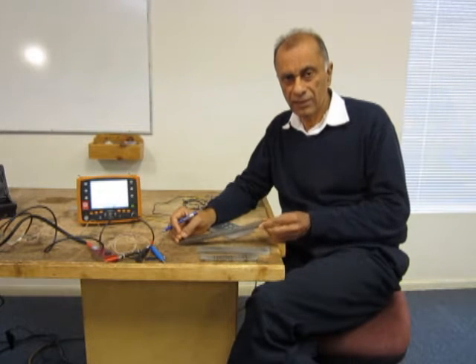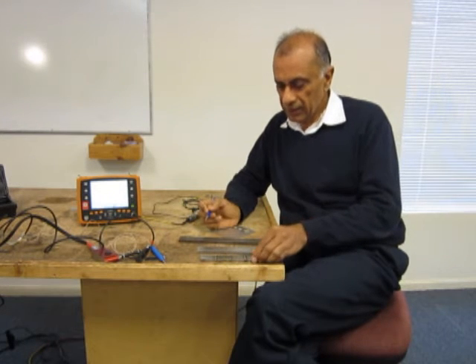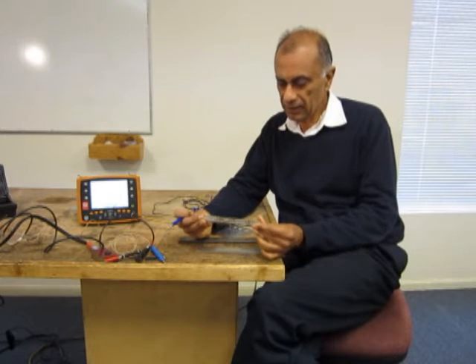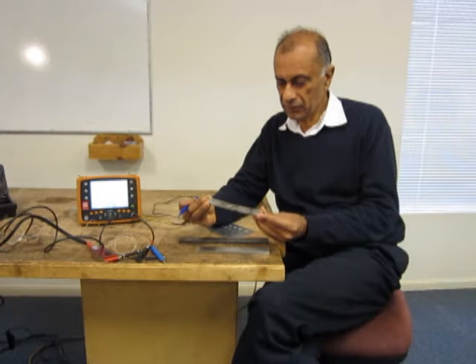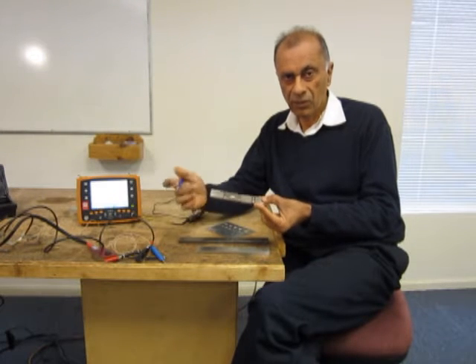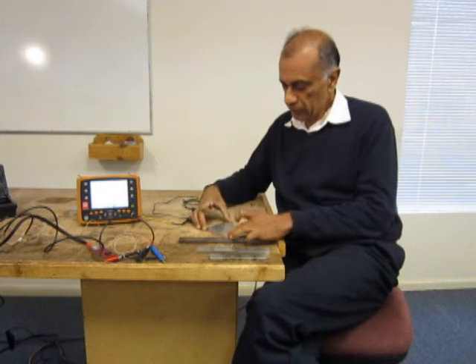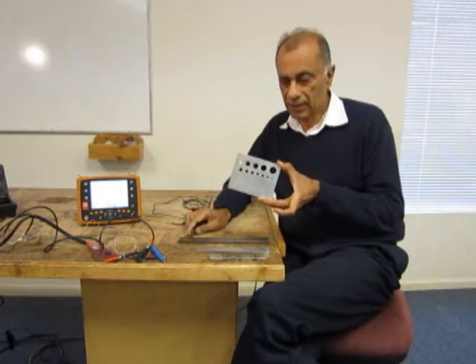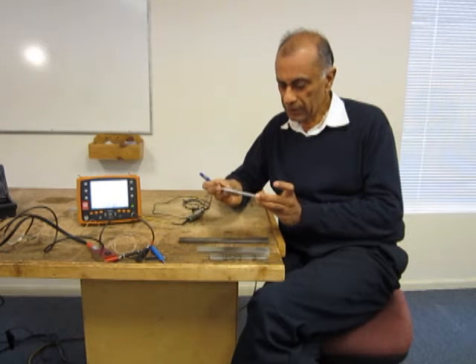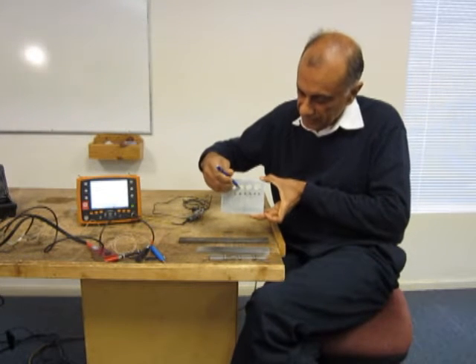Make sure that the notches are made by the process of EDM. If the inspection is done in welded structures then you would have a calibration block which has EDM notches as well as some weld beads placed on it. For aerospace structures there is a lot of inspection done for the bolt holes, and this is the calibration block for the bolt hole inspection. This is a special block and it has EDM notches actually machined inside the hole.